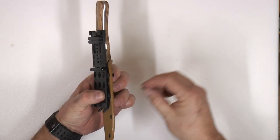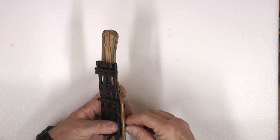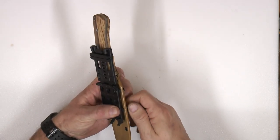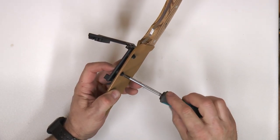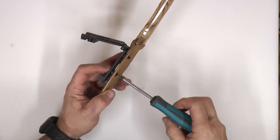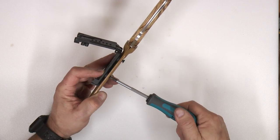Once you get these exactly where you want them and you get everything adjusted the way that you want, we do recommend that you take the screws out, put some Vibratite on them, and put them back in. When you use the Vibratite, we recommend the kind that helps with vibration so that it doesn't vibrate loose, but the kind that you can take loose if you need to.